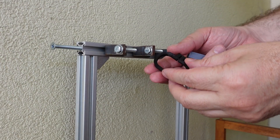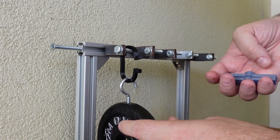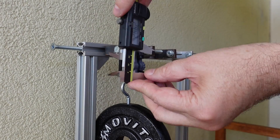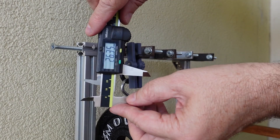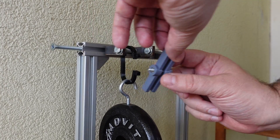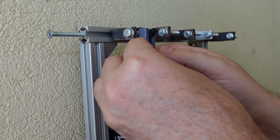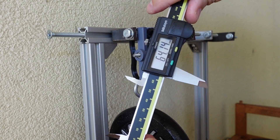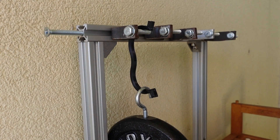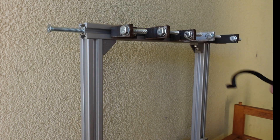A regular creep test to measure deformation under a constant load of 1.25 kilograms. Locking the position and measuring the distance between two reference surfaces: 26.35. I was expecting something similar with nylons because I know they creep — and this is the deformation after one day, after two days, three days, four days, and on the fifth day the weight fell down.